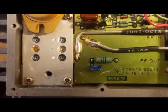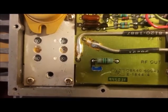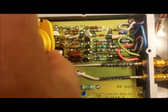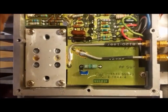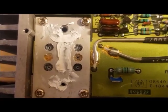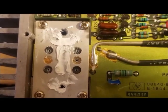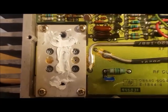One of the reasons I think this failed — maybe the number one reason — is because there's almost no silicone grease on it. On the bottom of this new one there's nothing either, so I'm going to put a bunch of silicone grease on it. There I've applied quite a bit of silicone grease between where the power amplifier and the heat sink meet. So now I'll put the power amplifier in and then we'll see how warm it gets.